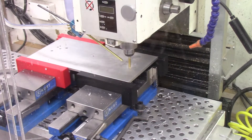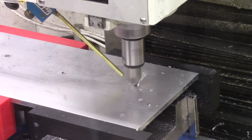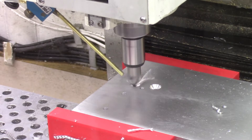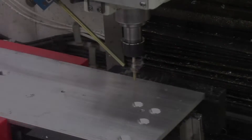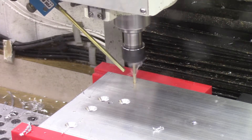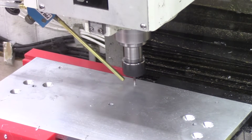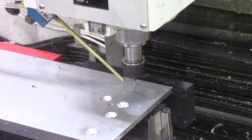This plate is to be used as a mounting plate for our Accu-Wedge system for the slicing of wedges for segmented woodturning. A countersinking drill bit is then used to countersink all the quarter inch diameter holes. These holes are for mounting this plate to a band saw using quarter inch, 20 thread per inch flathead machine screws. Finally, three holes 0.159 inches in diameter are drilled one half inch from the side edge of the plate, and thread milling is used to cut number 10-32 screw holes in those three previously drilled holes, which will be used to mount a dust guard for the Accu-Wedge system.